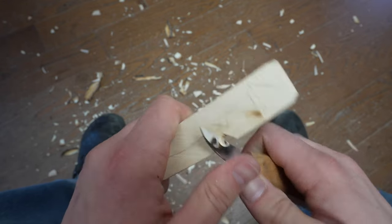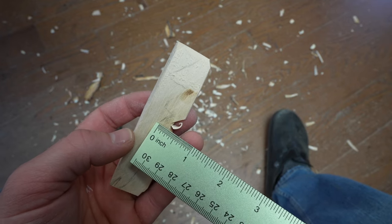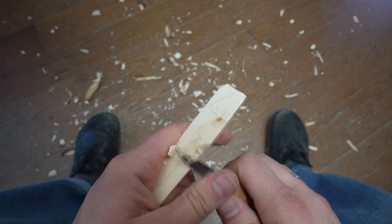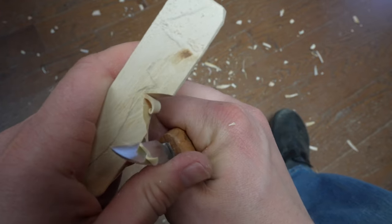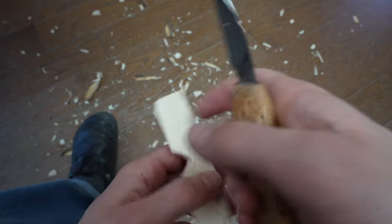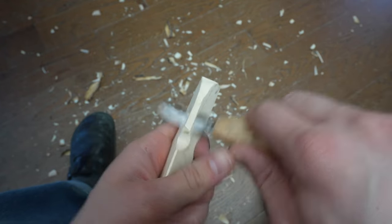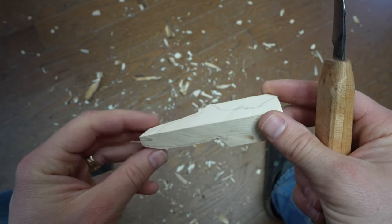This one's also going to be a little bit deeper — about half an inch actually, slightly deeper than that three eighths inch cut at the top. Back and forth, back and forth with that V-cut until we're at about a half inch of depth, like so. And we're going to do the same thing on this side — a gradual transition, transitioning that belly of the fish. Checking to make sure we're square and not angling in too much.